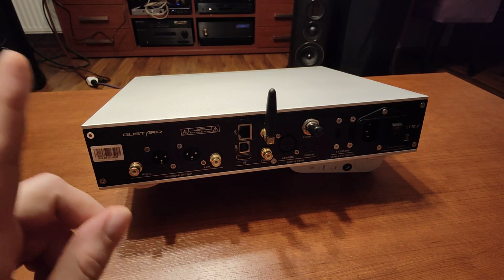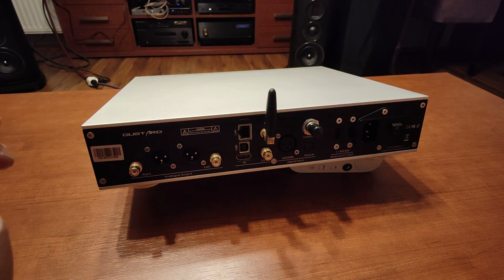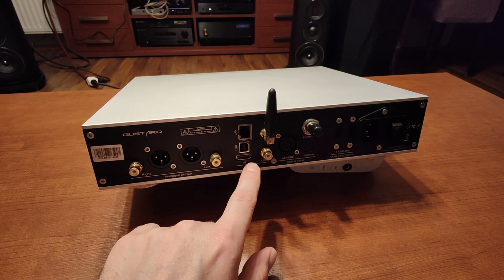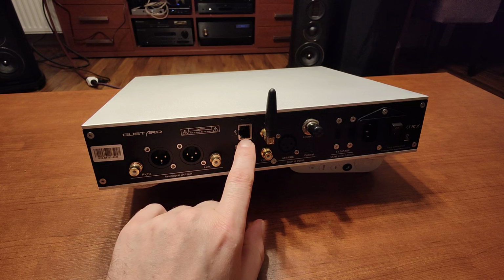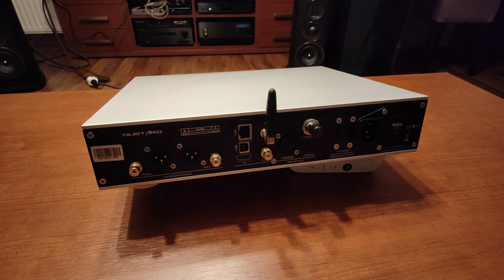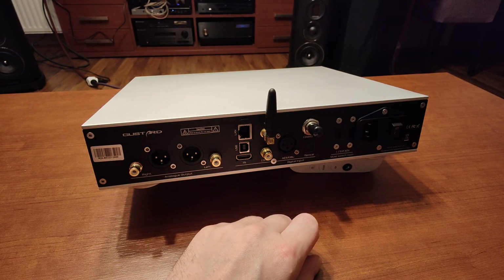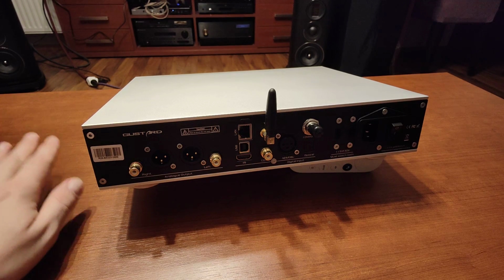So, but this is just the beginning. This is for the inputs as you have them on the unit when you buy it. But the discussion on HiFi is about the superiority of the I2S with external DDC converter versus streamer using external transceivers, external converters for wired Ethernet to fiber optic Ethernet, because this apparently clears the signal. And there is also a variation of this discussion about using external clock with I2S and DDC, or external clock with streamer and Ethernet converters.